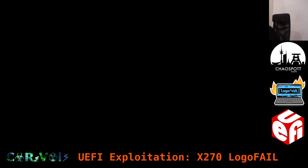So, clip back on. There we go. And connect the programmer. And, oh, yeah, by the way, we need to copy again. We need the hex editor again. So now we're looking for EBB6C0 there. And we're going to write my name in there, because funny. Alrighty, that's it. Control X. And now sudo flashrom, write it back.